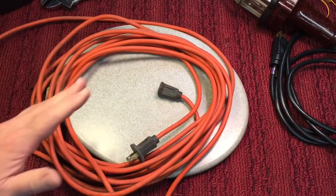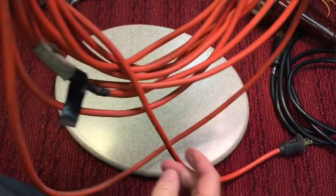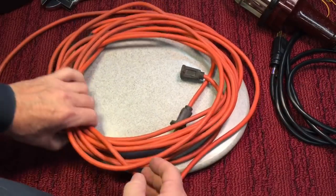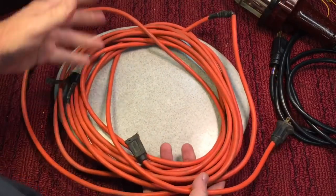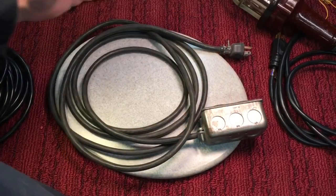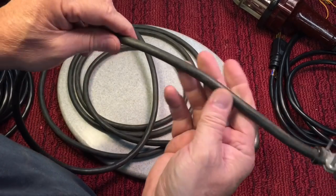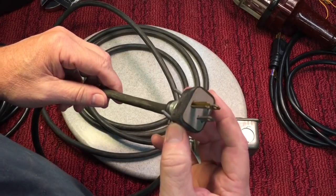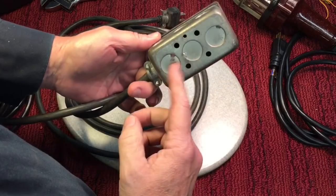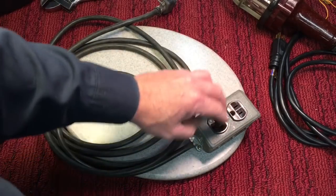Here is an extension cord I found in the garbage. Somebody tried to do a quick splice on it twice. But this is always good — you can make a short extension cord from it. Even though it might not be good for a long extension cord anymore, you can make a couple of short ones. The wire is always good for certain lengths. When I was younger, I would make up my own extension cords when I came across a good piece of wire like this. You would just buy the plug, put it on one end, and then put a gang box on the other side — a regular outlet, two or four outlets. This wasn't weatherproof or anything, but it was great for in the shop because it would allow you to have that extra 10 feet of length.